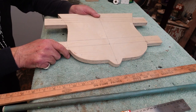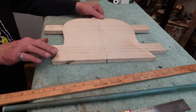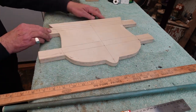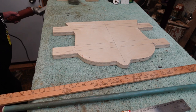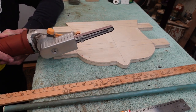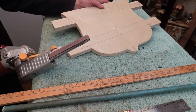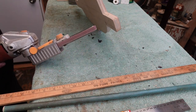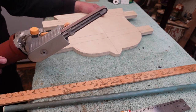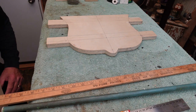Are you ready to be completely and utterly disamazed? Look at this — everything's cut off at the right length. You want to sand down the edges; some of the slivers that come off this stuff are terrible. The hero of the day was this mini belt sander — I've told you about this one for carving out cigar box necks, smoothing things out, cutting out metal pockets for a neck on a coffee can. When you're using a band saw and making curves, you can come along and straighten everything out with this. Best deal ever.